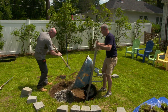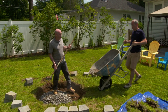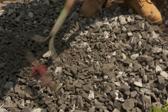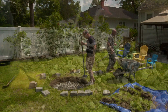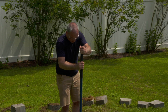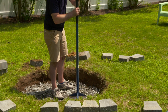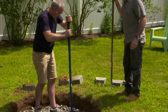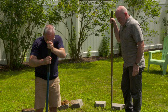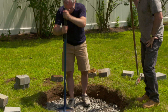Now this is two-inch trap rock, which is very good for drainage. Why is it important that we have drainage underneath the pit? We get a rainstorm, water goes into the pit, and we want it to be able to drain through the trap rock and into the soil to disperse. We're going to pack it with the hand tamper every two inches. How do you know when it's ready for the next course? It's going to feel very solid — it's not going to bounce the way it's bouncing right now. So keep hammering down.